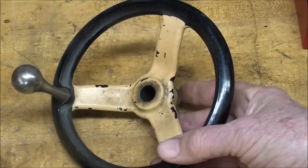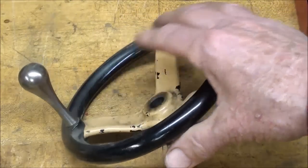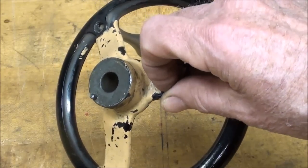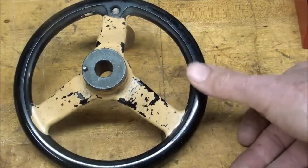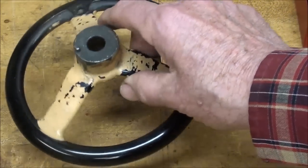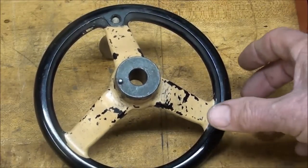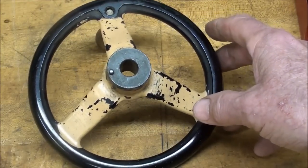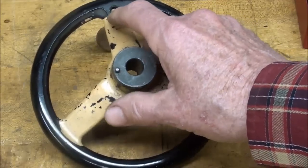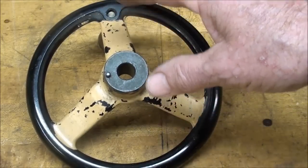Can you imagine this in a high school shop made out of plastic? They were very generous in making a steel knob, but the handle isn't going to break. If you've got a Bridgeport, these aren't even held on by any method, so they slide off and end up on the floor. After buying several of them at considerable cost as a replacement, I actually cast one by this method. What I did to start with was I glued the two pieces together — I think it was in three pieces — just so that I could use it as a pattern.